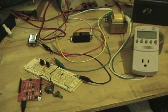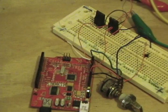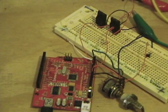Hey, this is Nick. While working on improving my coil gun charger, I ended up building a crude but effective AC inverter. Basically right now I've got it hooked up to a 12 volt wall supply, but you could just as well use a lead acid cell or something like that. It's really simple — I've got an Arduino over here which is switching on and off those IGBT transistors in the back.